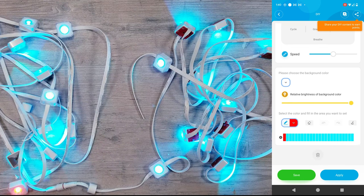And what this means for the animation is that when the red light reaches the 23rd LED, ideally, we would want it to then go immediately to the first LED and start over, but instead, the app still thinks there's 24 pixels in service, resulting in a very short delay before starting the cycle over.